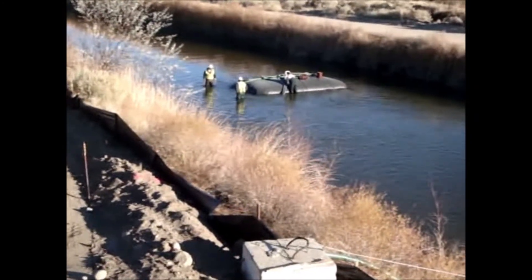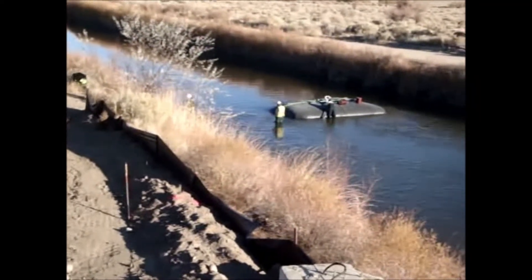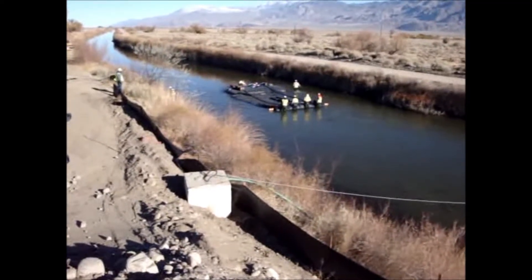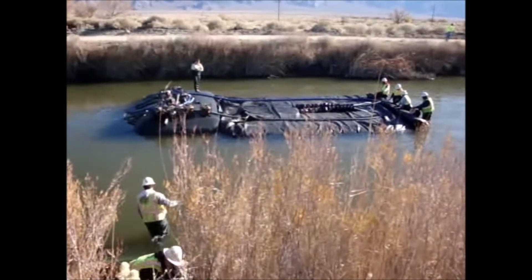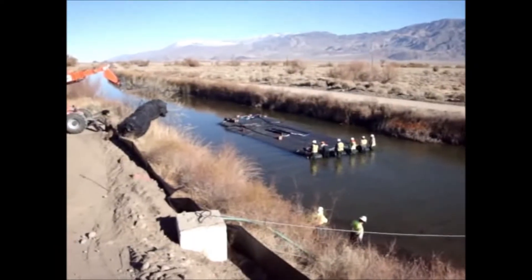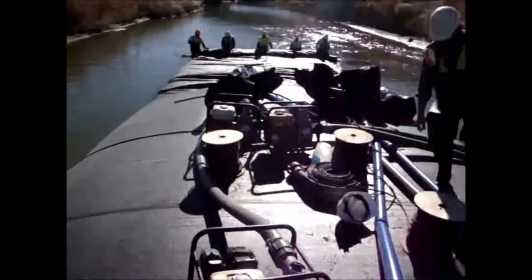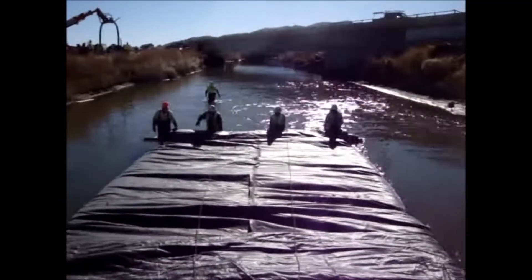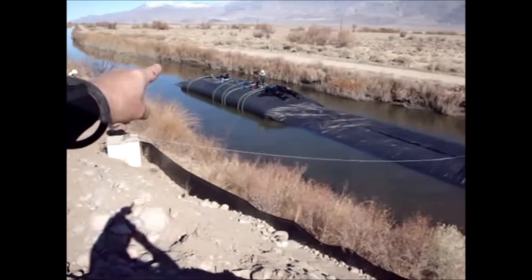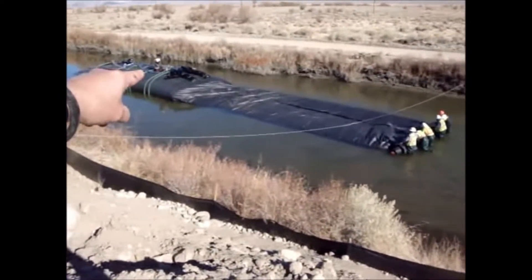At the start of our operation here in the Owens Valley, we've got one little dam in so that we can set our pumps on it and start the next aqua dam. We're putting out an eight-foot high by 50-foot long double closed-ended dam. We've only got two pumps running on this aqua dam. We started with a little four-foot by 20-foot long up here, then we put an eight-foot by 50-foot long with a collar on both ends, then we are adding an eight-foot by 150-foot here.